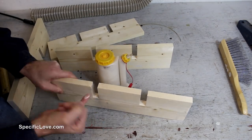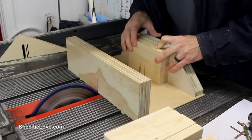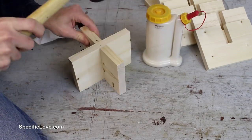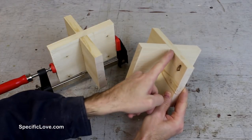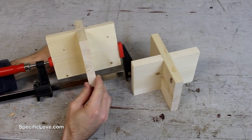So I carefully separated the boards and added some wood glue and gently tapped them back together. I then took the 6.5 inch board to my table saw where I cut dadoes at the center of each, and then glued those in the shape of an X. In the process of hammering these together there is always a chance for them to split, and if they do just take some extra wood glue and clamp them back together.